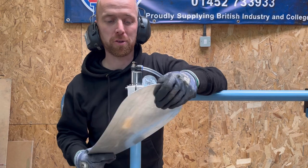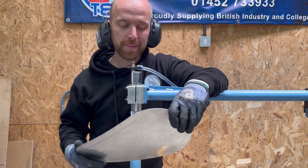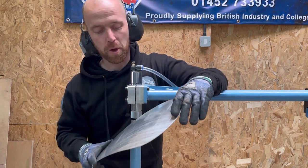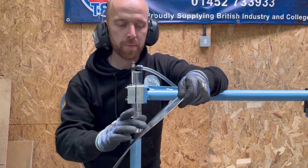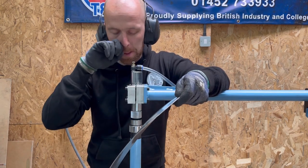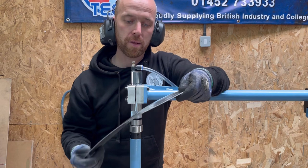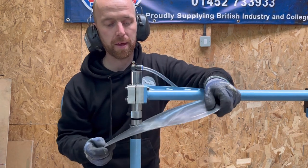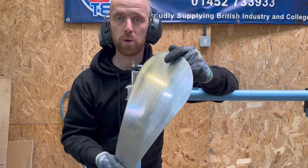This is part two of my sample pieces — this blister is the type of thing you'd find on a pre-war car, either on the bonnet or the bodywork, just to give a bit of space. I'm going to treat it in the same manner as flattening the weld. Because I want to generate more shape, I'll start on a lower radius anvil and then as the shape generates I'll swap to a different radius anvil to suit. I'll blend it down into that teardrop shape and show what's involved and what you can create.